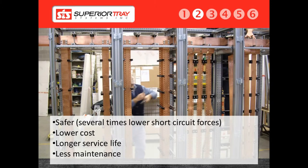A disadvantage of a bus duct is that they typically sandwich multiple bus bars together, which creates a single, large conductor for each phase and neutral circuit. Conversely, CableBus systems typically use multiple conductors per phase. In the event of a short circuit, high current running through the conductors creates large magnetic fields around the conductors. The opposing magnetic fields generate forces between the conductors. Since a cable bus has multiple conductors per phase, the cables are arranged in a specific manner in order to cancel the magnetic fields generated during the power transmission, reducing the forces created between the conductors during a short circuit compared to a bus duct,